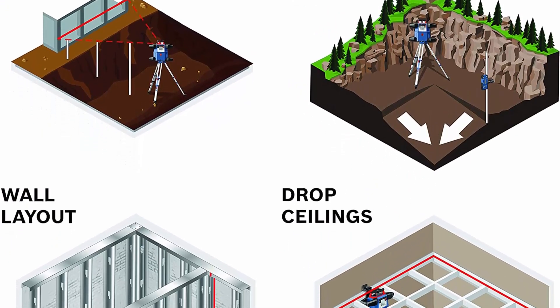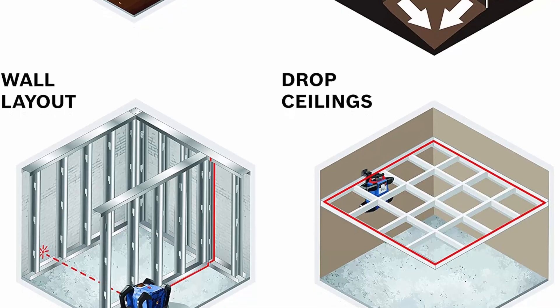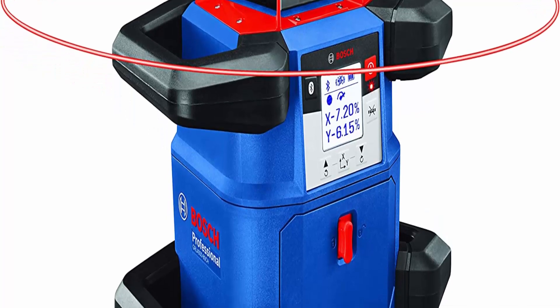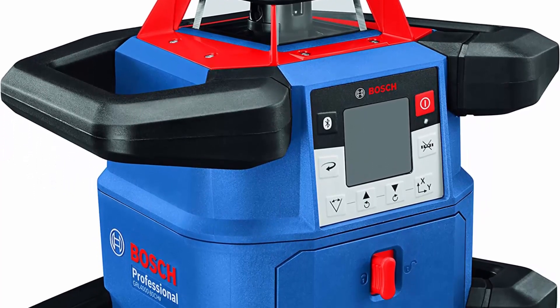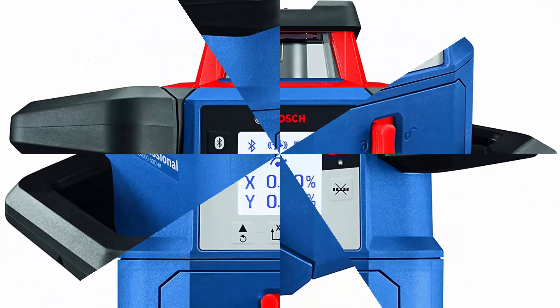The app controls sleep mode, dual dial and slope, and user calibration, guiding the user step by step to confirm tool status or calibrate the rotary laser to ensure accuracy on the job site. Class II Laser Product, 1 mW power output, 630–650 nm.